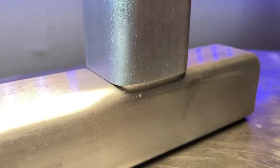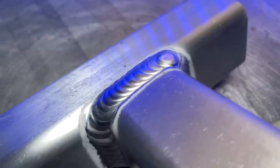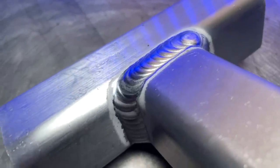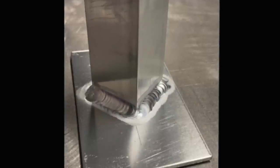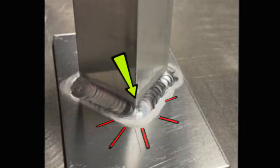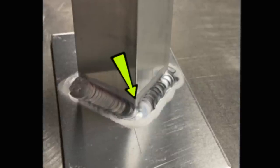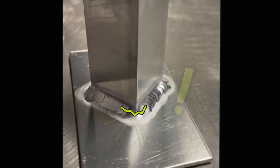Aluminum is a little bit softer than mild steel or stainless steel. When you have welding distortion or stress straining on the part or joint after it has been welded, this is going to put a lot of strain and pressure on an intersection of welding like this. If we have any open corners, gaps, or voids like what we're looking at here, this is going to be extremely prone to cracking or something like that forming later on down the line. It's very surprising how easily some of these things can happen — we may have cracks forming in the actual area.